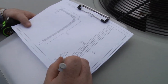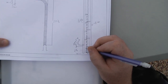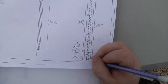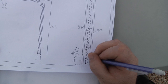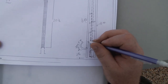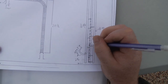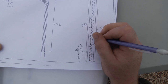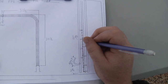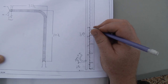I've got a return bend there, or hairpin — hairpin there, which completes this sub cooling circuit. Hairpin, hairpin, hairpin, hairpin — which is going to complete the hot gas to the collection header circuit. Make sure your circuit always makes sense.